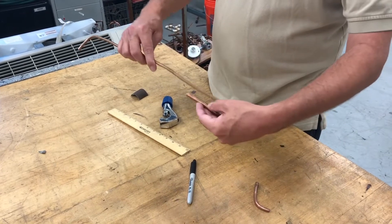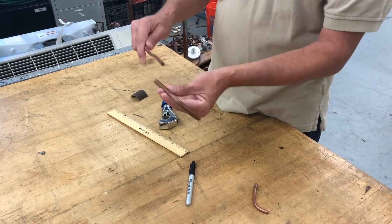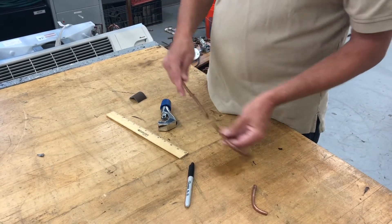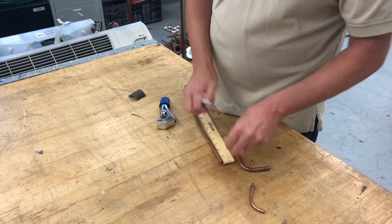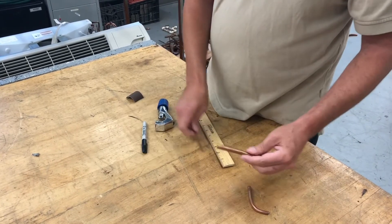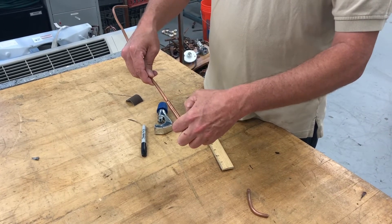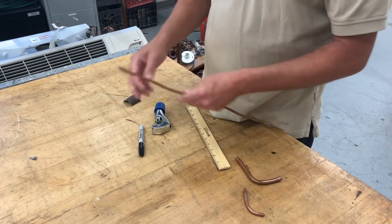I don't want to push it all the way in where it could restrict the flow. We only need about an inch of pipe within there. I'm going to mark where I need it to go and where I want it to stop — but that mark is going to go away, because if we braze right there it could impair the braze. We don't want dirt, we don't want any corrosion, and I need to sand first before brazing.